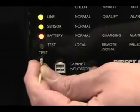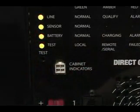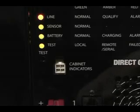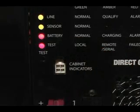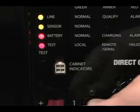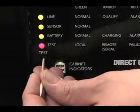If the power supply were to fail a test, the test LED will turn red, indicating the battery is not connected or has failed the test. To clear the test, reapply the battery and wait for the battery light to turn green. To clear the alarm, press the test button again.